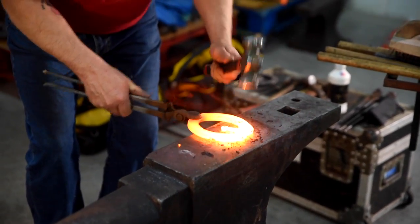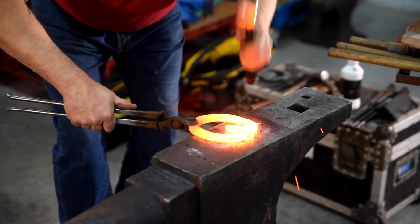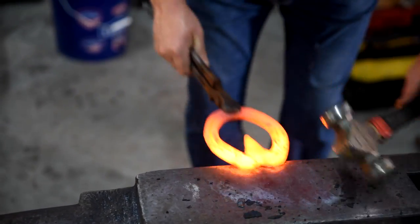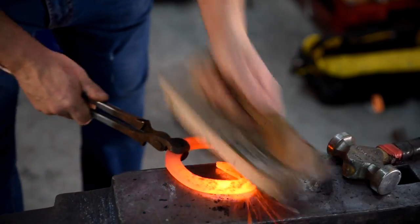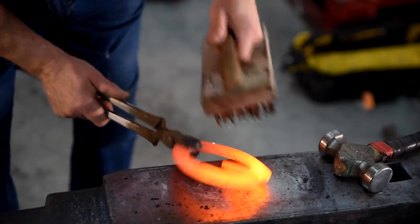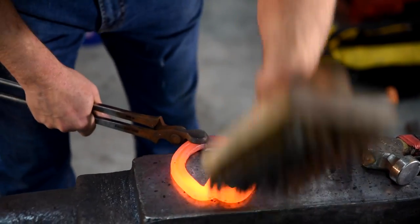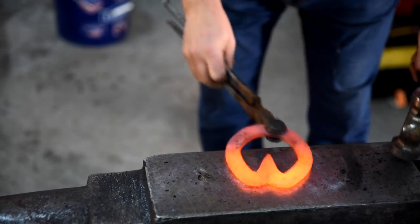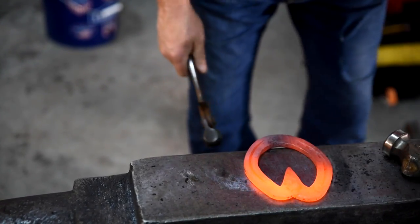Okay, so when I bring them out and they're ready to weld, I usually hit the apex of the frog first, just to get that stuck before I move on to the scarfs. I don't do the scarfs first because I don't want the apex of the frog to slip or move off one another. So I stick them in the apex first, very quickly, and then move on to the scarfs, and then quickly turning it over and doing the opposite scarf. And then you can work across the whole body of the frog.